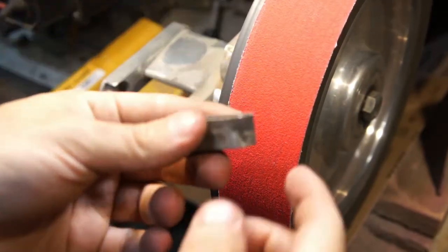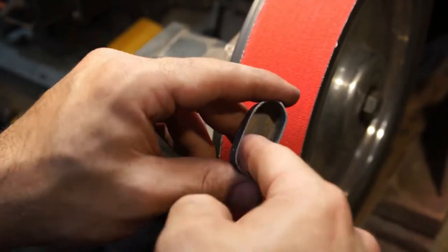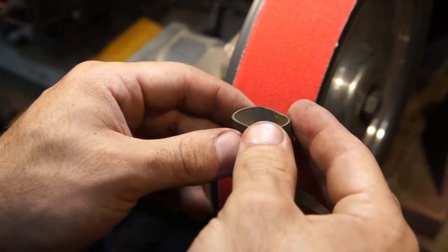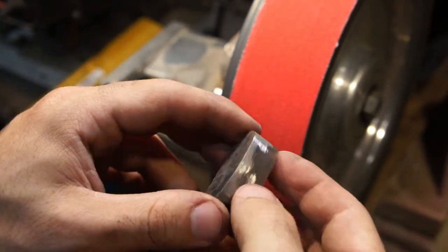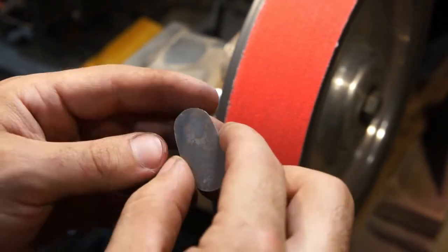It's looking pretty good. It's mostly smooth in there. Just got some little extra bits to clean up. Okay. Back to the bench. Alright, so I went back and used the burr on it again, cleaned up any stepping that I saw, bead blasted some more, and I went ahead and etched it to get a closer look at it. It looks pretty good. All the stepping's gone.